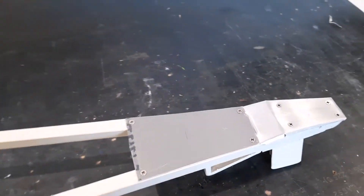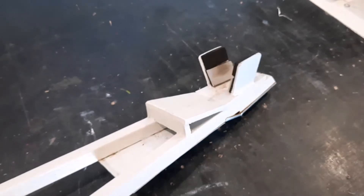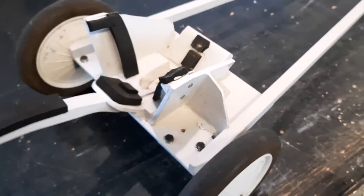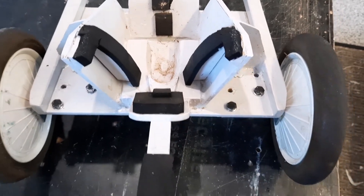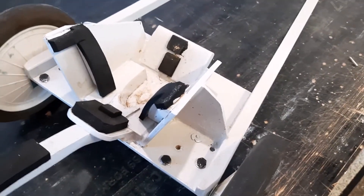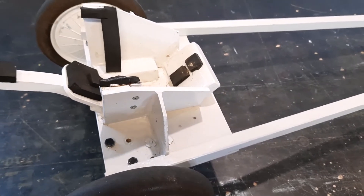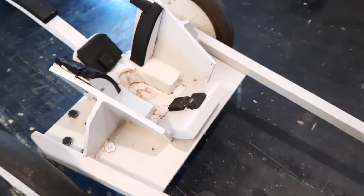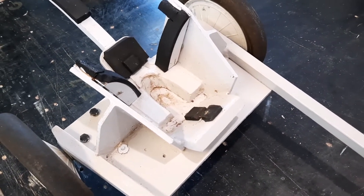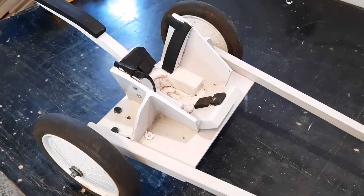The piece of aluminium on the front just stops the grass from getting caught up in the back section and the little ramp. For construction, what I used was six-millimetre ply — I build kayaks out of plywood. One of the secrets to something like this is to tack the plywood in place with CA super glue just to get it all set up, then put fillets in with epoxy and cabosil or wood filler.